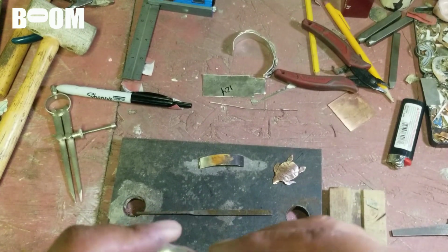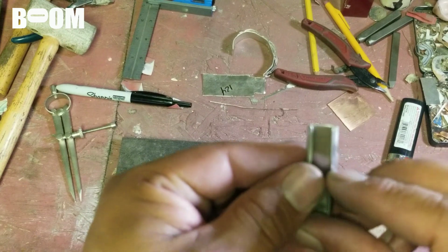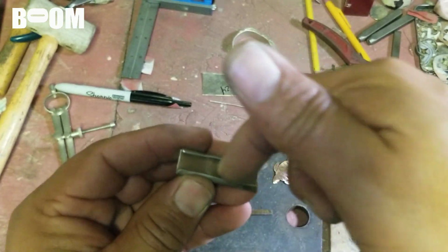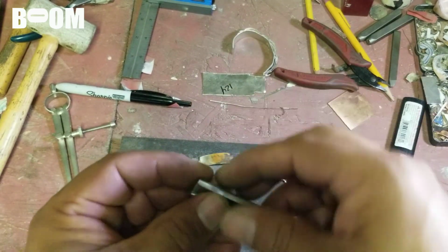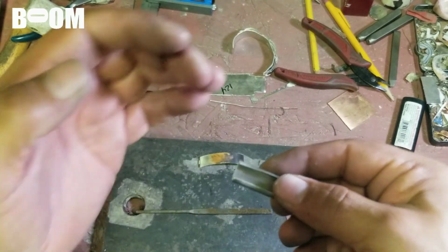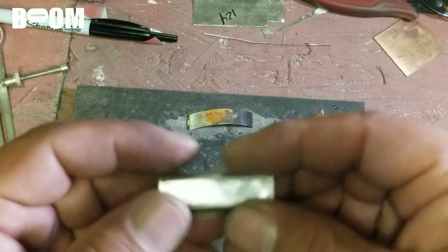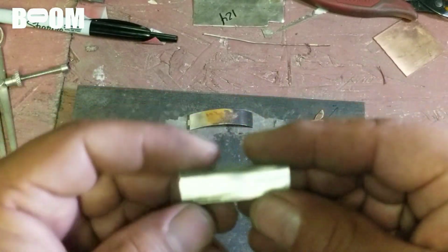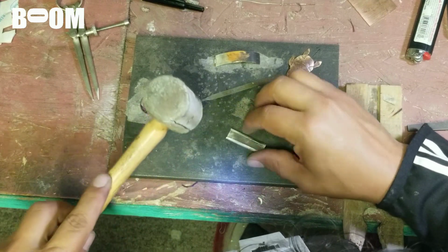Okay, so I wanted to share this with you guys. I softened these edges here, but I also went underneath here and softened under there and softened under there. So while it's flat, probably soften the whole thing and then round the edges while it's still flat. You know, I'm always getting better. And when I watch this video next time I make this, I could just refresh, because I think I knew that, but I forgot. Light taps, friends, light taps.